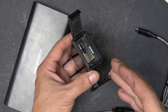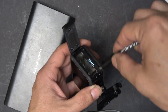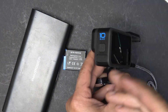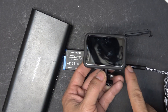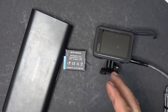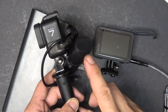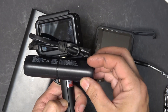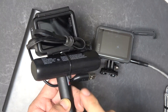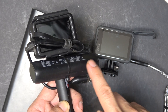You can solder wires from the BMS and run them to the outside externally. At this point some of you might ask: why not just use the USB-C connector and connect it to a USB power bank? Well, because this is a GoPro 10, the USB input has to be 2 amps or more, and it is extremely picky about which power bank will work. This is a GoPro 7 model and I use an external USB power bank with it — it's really small, there's only one cell inside, so it's very small and portable.